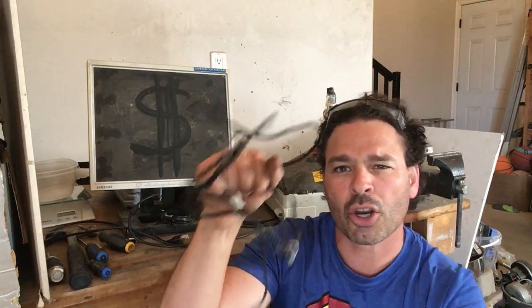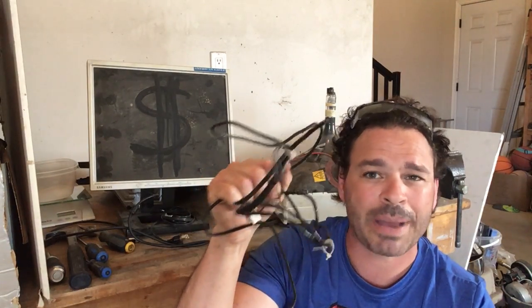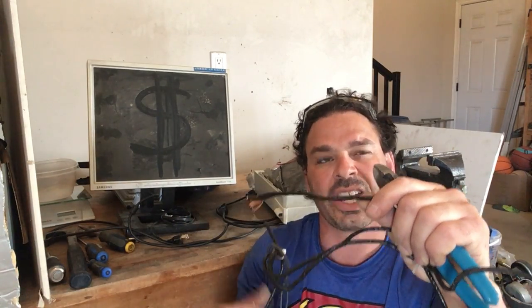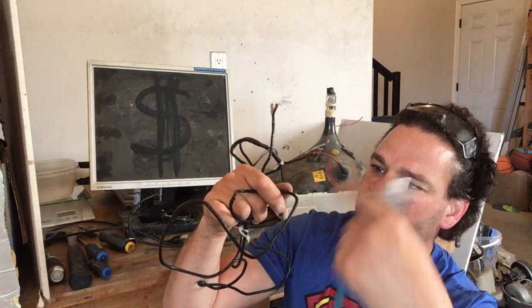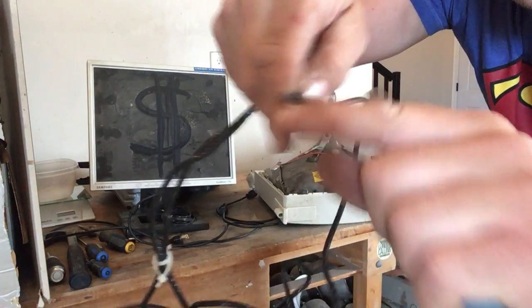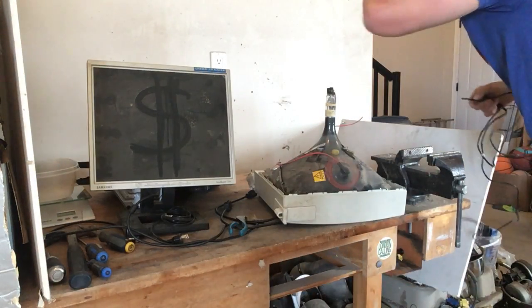This being number two copper, currently in London, Ontario this copper is going for $4.45 a pound, which is an excellent price. If I was to leave the outer coating on it, I'm going to get 60% appliance wire price, which is currently $2.75 a pound. So I definitely want to take off this coating. It's just like a tape that's wrapped, and all I do is take a knife and just slice down the side — very easy to do.